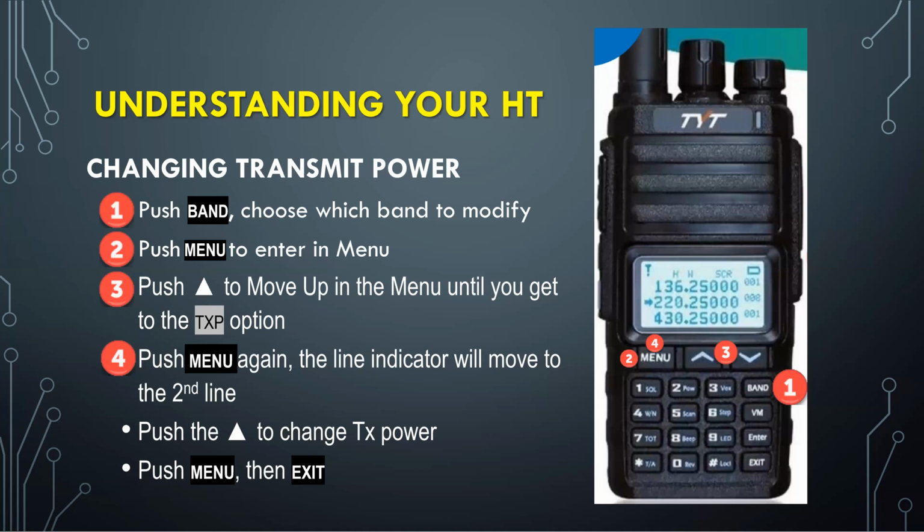Exactly. So if you're trying to hear a very weak signal, you turn the squelch down, and you can hear those little weak signals popping above the noise. When you get a stronger signal, you just turn the squelch up to block the noise. Many radios have a button that turns off the squelch momentarily while you're holding it in. So if you think somebody's out there that you're not hearing, you can open the squelch, which lowers it all the way down so anything comes in, including noise. That hiss is just random radio signals that your radio doesn't decode.